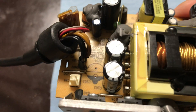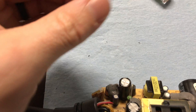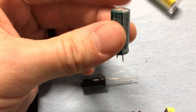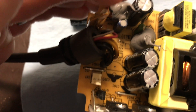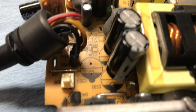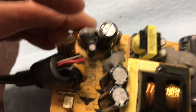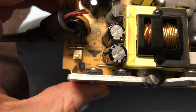As you're installing the capacitors, make sure you get the orientation right. Notice that all capacitors will have a line down one side — see this white line down this side? This is the one I pulled out of here. You want to make sure those are oriented in the same way, and they're marked on the board so you don't get lost. The line will line up with the dark side as indicated by that circle on the board. You can also check the indicators of other capacitors on the same board — there's another capacitor and you can see it lines up with that black tab there.